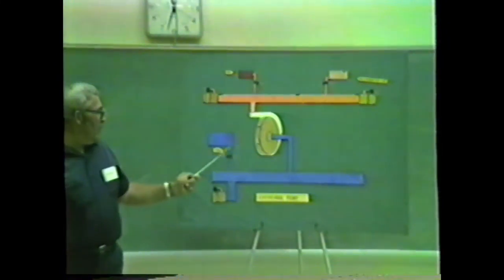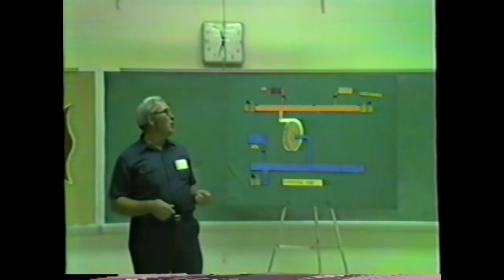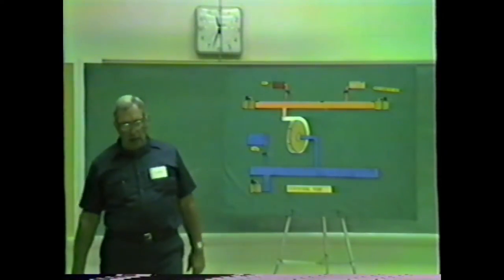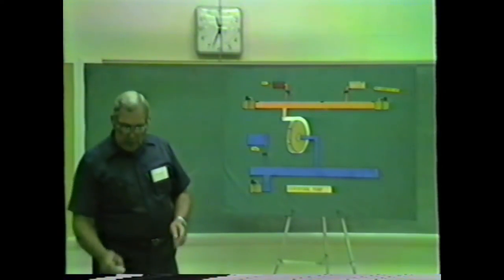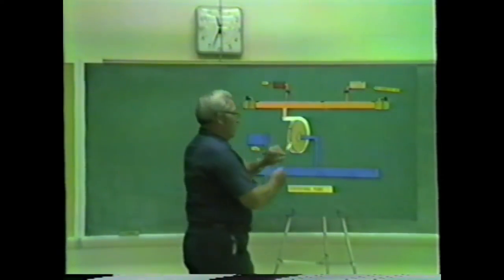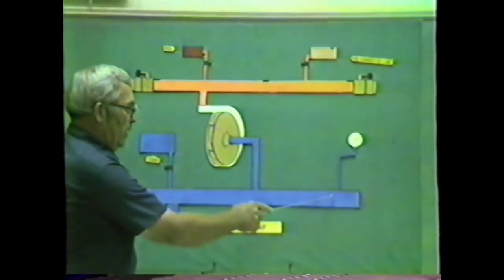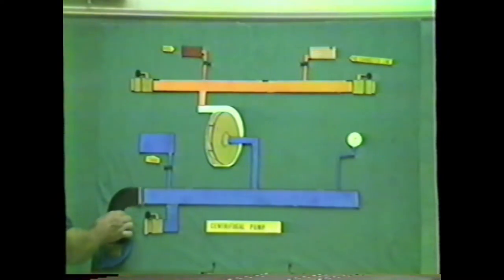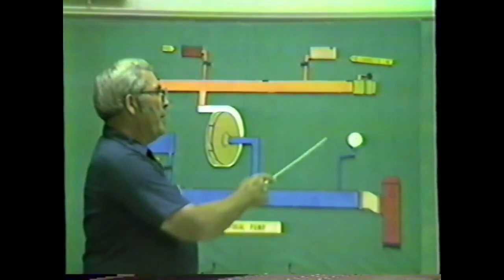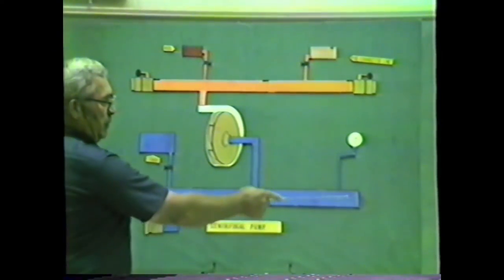At this point we have a source of water, a way of getting water into the pump, a way of building pressure, and a way of getting the water out, but we can't really tell what's going on. We need some gauges to monitor pump performance. We have a group known as pump gauges, broken into two sections: master gauges and individual discharge gauges. Starting with master gauges — we've got two of them. The first is called a compound gauge, which tells us the pressure of the water coming into the pump, so it's plumbed into the intake manifold. If water is coming from a static source, the compound gauge shows a vacuum reading; from a positive source, it shows positive pressure. It's called a compound gauge because it gives two different readings.